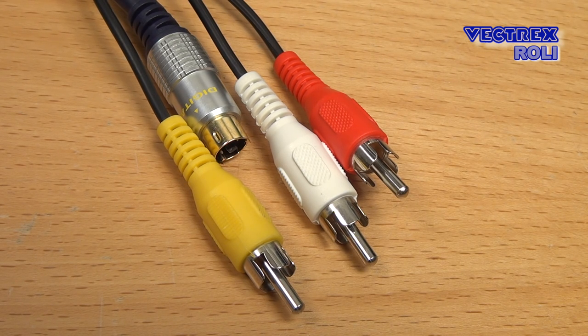There is an SVHS component signal connector for the best video quality you can get for the 40 column output, as there is no RGB out available there. If your TV or monitor cannot handle SVHS, you also get a composite video signal, of course, and picture quality looks slightly worse then. There is also a Cinch or RCA connector for audio output. As I said before, the more modern version of the Commodore VIC graphic chip creates stripes on the screen, but this has nothing to do with the video cable. Unfortunately, I've not seen any 80 column C128 cable made by Retro Computer Shack.